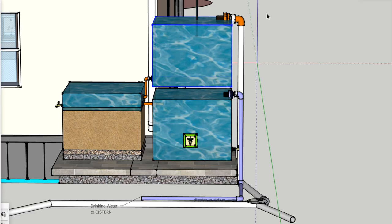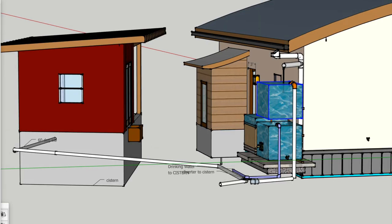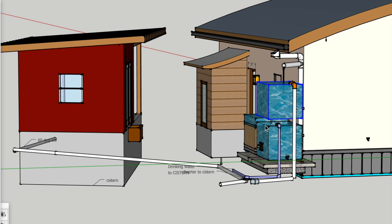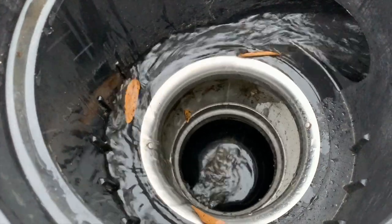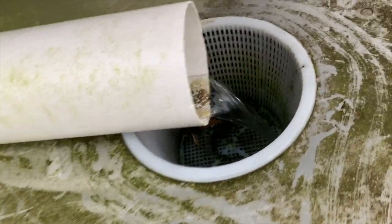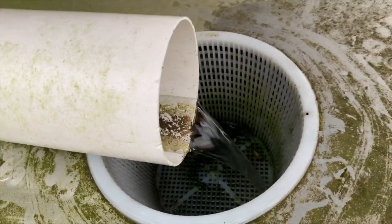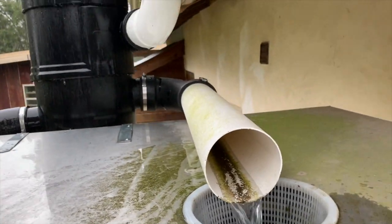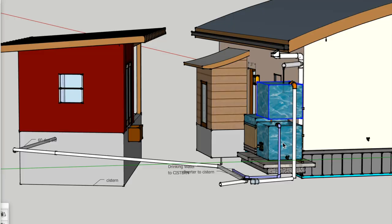This is a really effective way to collect a lot of rainwater and purify it to make sure you have a year's supply. Every time it rains you have a 300-gallon reservoir, even if the tank started out bone dry. To give some perspective, this is a thousand-square-foot roof — we get about 600 gallons of rainwater collected in a one-inch rainstorm, which is a pretty typical rainstorm. So we're going to be able to fill two of these entire tanks and have two years' worth of water from a typical one-inch rainstorm.